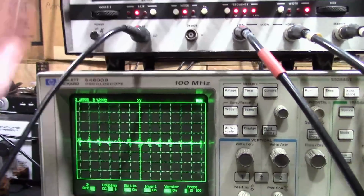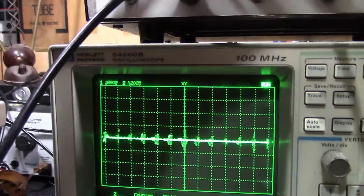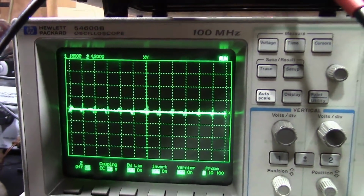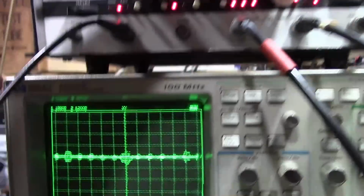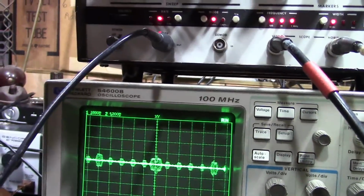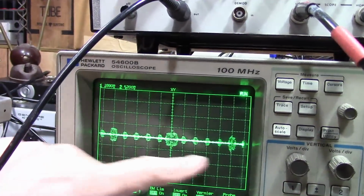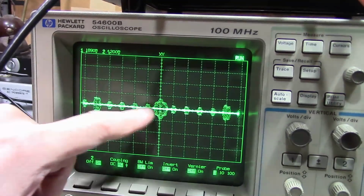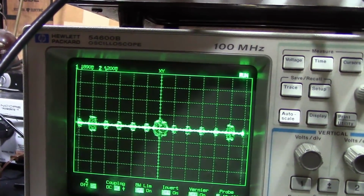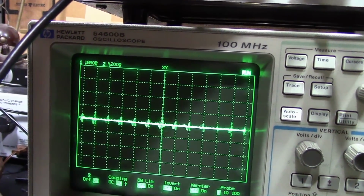If I turn on the ones, it gets a little crazy when there's a blip on every single tick mark there. A few controls for the markers. You can set the width. I can make them wide. And the way the built-in markers work, the 10 megahertz markers are bigger than the 1 megahertz markers. So that's what the largest marker, blob size, the medium, and small.